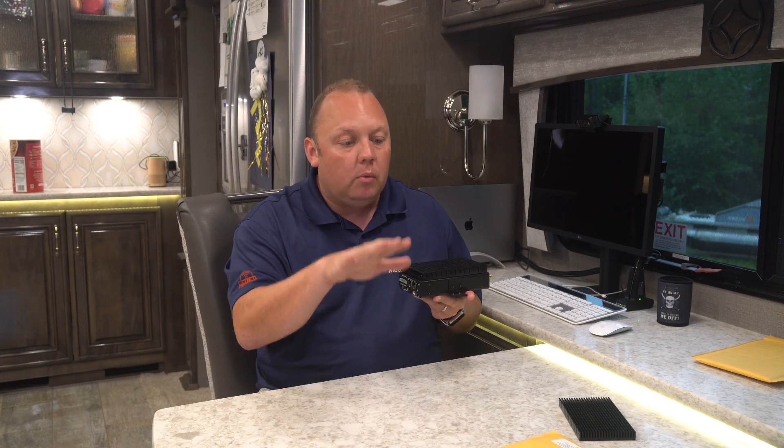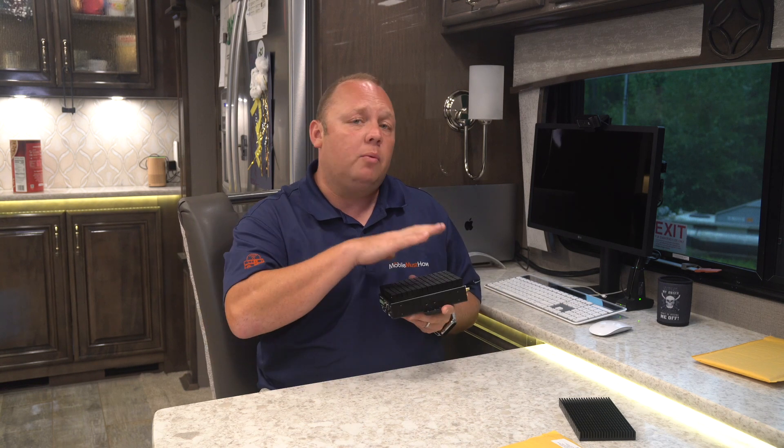The net effect is that the device can run at a high temperature — it's warm to the touch. We often tell people: can you touch the device? If yes, is it burning you, are you pulling your hand away? If not, and it's just very warm, you're fine. If you find yourself in a situation where it's hot to the touch, check your environmental settings — you may not have enough ventilation. These can run very hot, but if it's too hot to the touch, look at adding a heatsink, and if you're in a cool environment and it's still too hot, contact us because you may have an RMA situation.